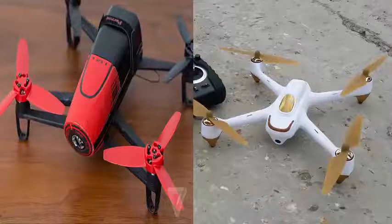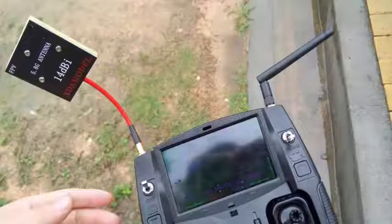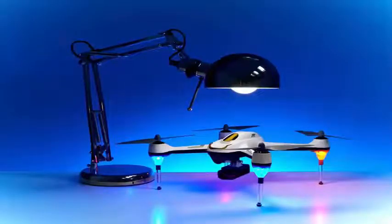On modding: neither drone supports hardware changes easily due to a lack of modular construction. Spare parts can be found, but replacing them requires tools, skills, and some courage. The only accessory available for the Hubsan H501S is a static gimbal for an external camera, though the quality is poor. However, the Hubsan standard controller can easily be modded for under $20 — you can install external antennas for both 2.4 and 5.8 GHz, with users reporting over 800 meters of range after this mod. Bebop users have found ways to increase range using Wi-Fi extenders.